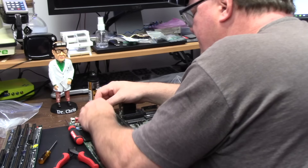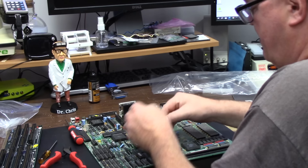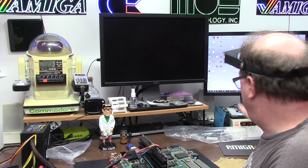Because they get frozen in time and might not be making contact properly. This is just my preliminary pre-flight checklist. We have no PAL or NTSC jumper, so that might explain the RGB issue. We're going to grab a nice yellow one for that. This is America, so it's NTSC.